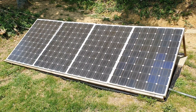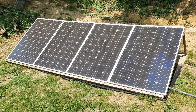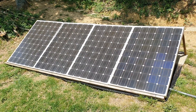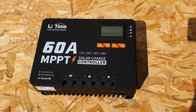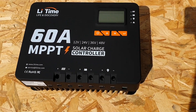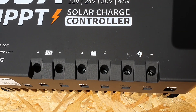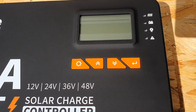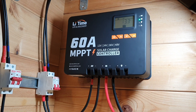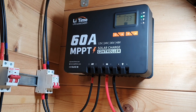If you live in a very cloudy area you might prefer running panels in parallel, and that works just fine. However, in series you will get the absolute maximum power, especially with this MPPT charge controller. Another feature I really like is the three-year warranty — great to see that. There is also a DC load terminal so you can run lights, a pump, or other DC loads. You can pick up a discount with my code 'thegoodonroad', saving you five to ten percent, and check out their 'like new' section where you can sometimes get 40 to 50 percent off retail price.